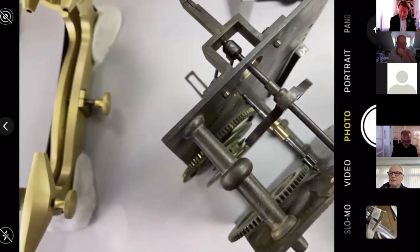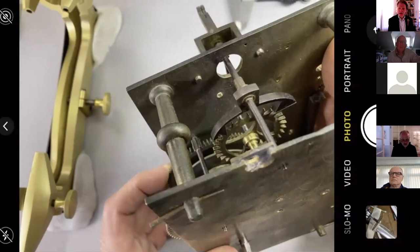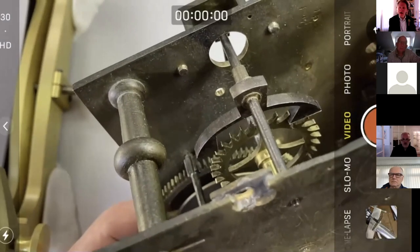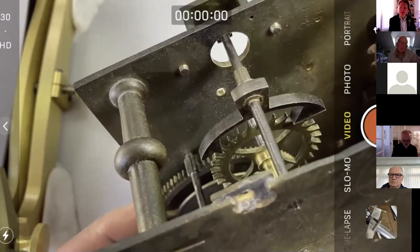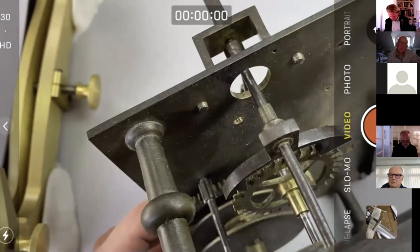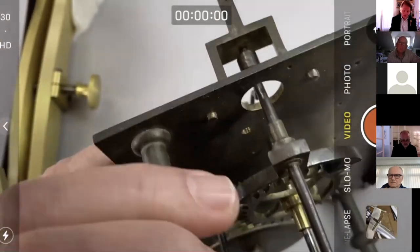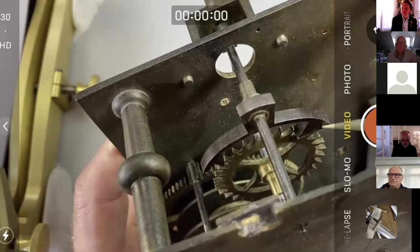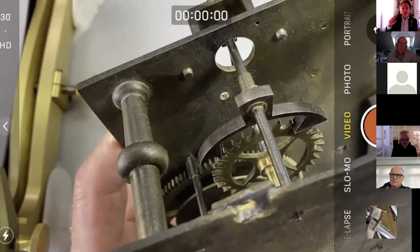Okay, right. So 2 weeks ago, 3 weeks ago, we talked about refacing pallets. I can't remember who asked for it, but we did it. What we did here, as you can see, it's got some spider's webs on it, was we refaced the entry pallet here. We put a new piece of hardened and tempered steel on it to reduce drop. Because the other pallet had already been refaced, we just did one.